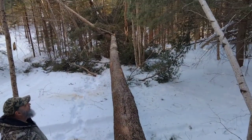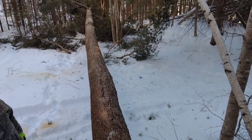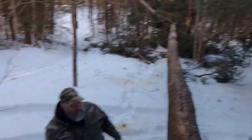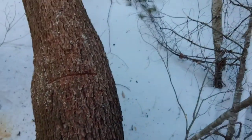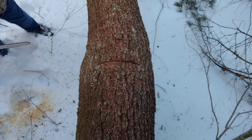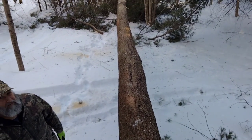Okay guys, we got it all marked off - we got seven eight-foot usable logs out of this tree. Seven logs, eight-foot-three-inches long - that's quite a take for one tree. We cut this one just a tiny bit longer because we have this rot spot - it's not a raw spot, it's where another limb grew into the tree, but it's going to yield less lumber at that end. So we're going to buck it up and then get out of here.